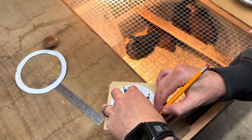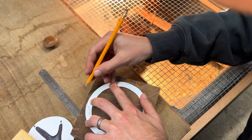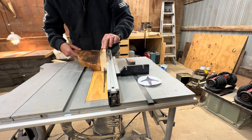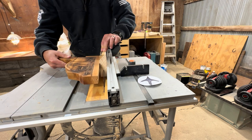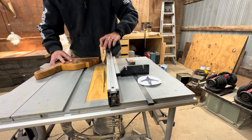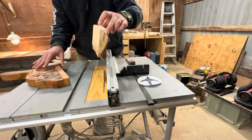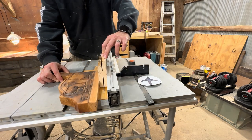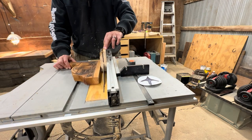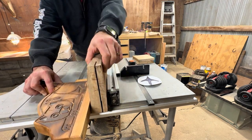So up to this point I'm just cutting out my stock materials, getting everything to size, and you can see me tracing two circles on the pieces. I've got a piece of walnut and a piece of ash. My plan is to make these two circles — one's going to be a lot smaller than the other and they're going to fit on top of each other. At this point I'm just cutting this piece in half to get it down to a smaller size because it's thick and chunky, like an inch and a quarter, which is much too big for what I'm looking for. I'm using this resaw method like you've seen me use in other videos — still don't have a bandsaw, working on it — and then we're going to size it down into that circular shape.